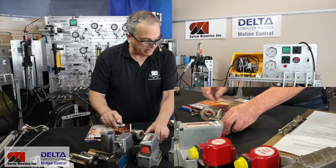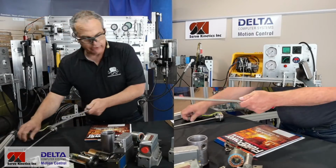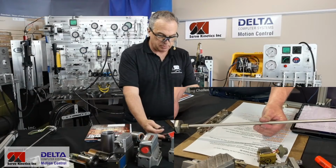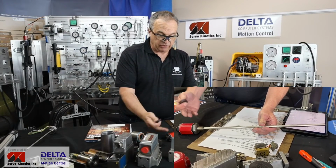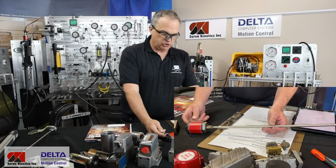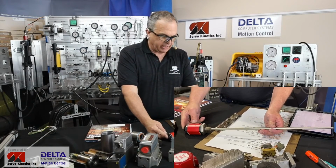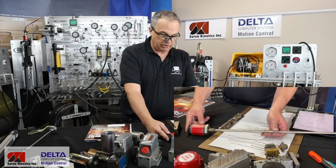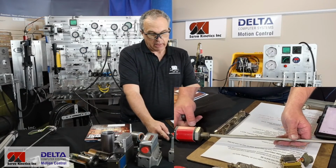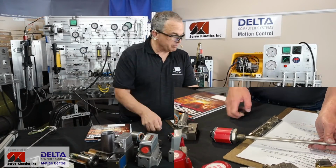All right, so you've had a little bit of a look there, and while we were looking at pieces just lying about loose on the table here, we might as well have a look at a pretty typical magnetic displacement transducer. These come with electrical output in a variety of styles. Could be analog voltage out, it could be 4 to 20 milliamps current out. Other styles that are very popular with servo cylinder controllers are a pulsed style of output called start-stop, or PWM, pulse width modulation.